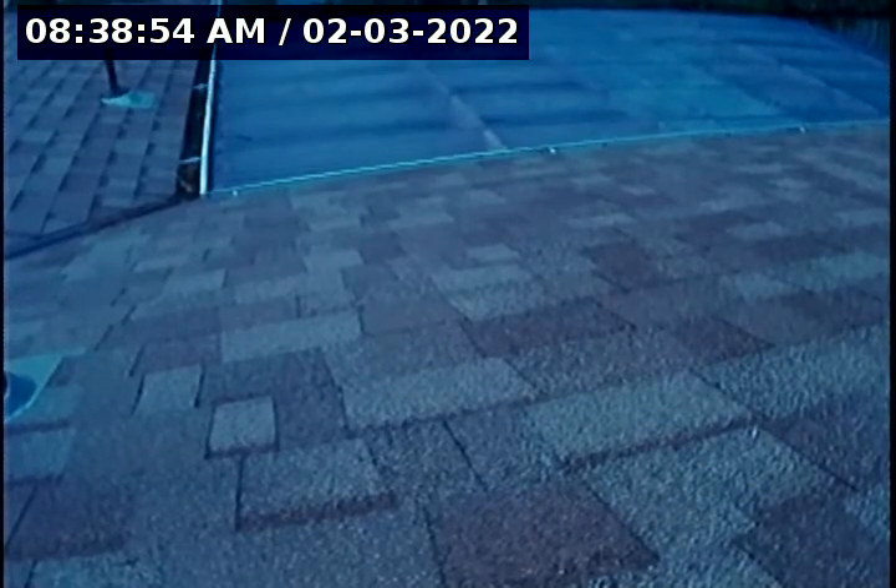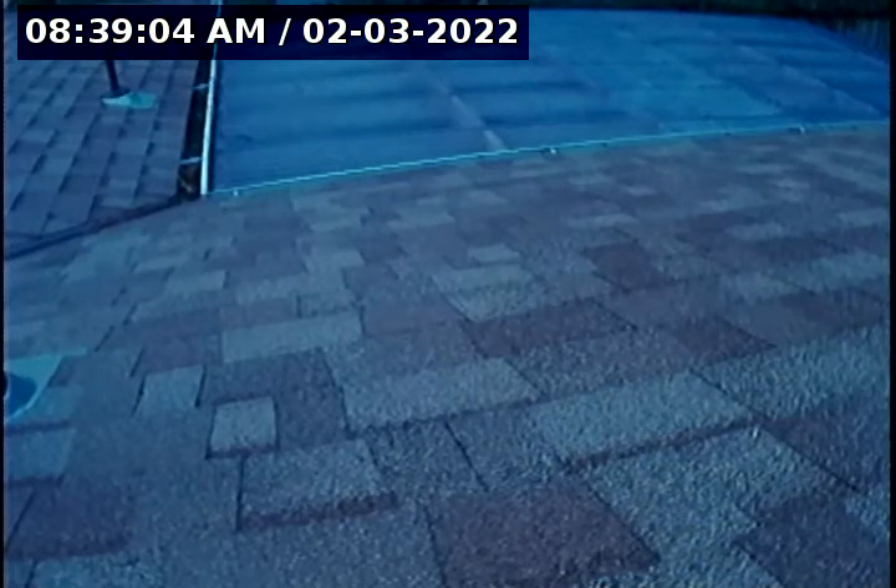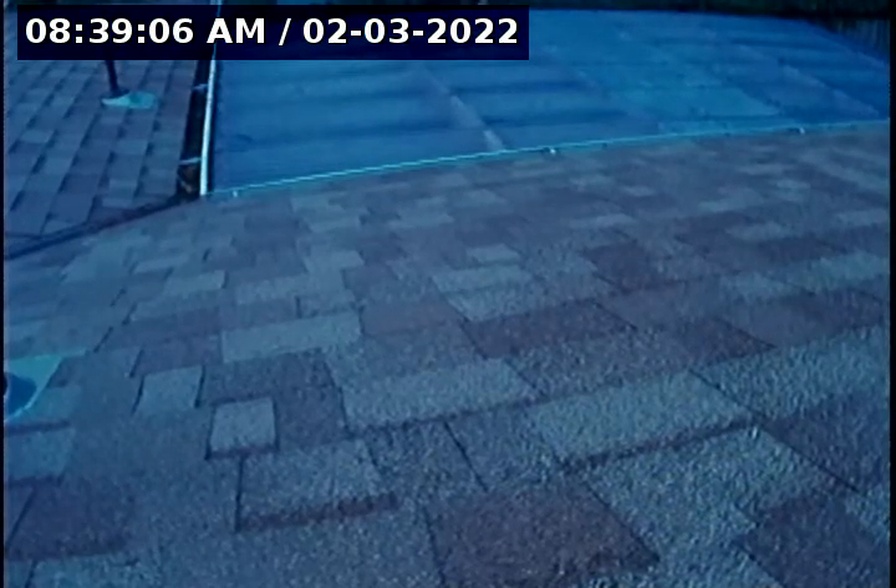The house is facing east. I'm here on the south side of the house on the roof. There is a clean-out on the east side of the house. I was unable to remove the cap — it's on there very, very tightly. Probably an invasive removal, meaning I'd have to chisel it off or use something else with leverage. I took a hammer and a plumbing wrench to it and it still wasn't removing, so I didn't want to break the line.